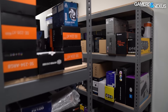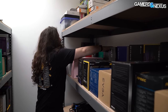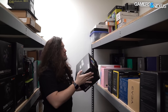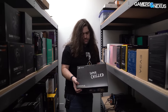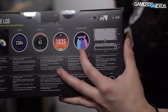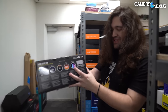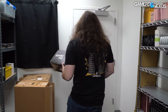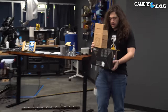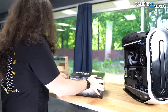I want a 240mm. I'm not going to be too picky about it. The H100i Elite is very new and pretty expensive — you're mostly paying for the pump cap aesthetic, since performance is the same as a significantly cheaper cooler. But that particular image is perfect for the Alienware computer. I don't think a 120mm tower cooler is going to be enough for a 12900K to sustain 240 watts, so the 240 is our best bet. Time to see what will actually fit.